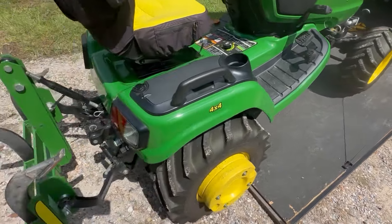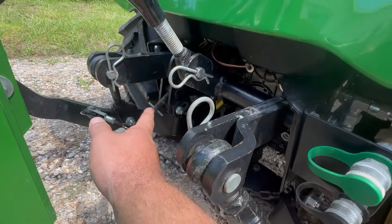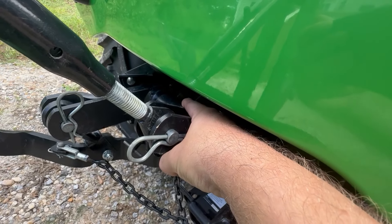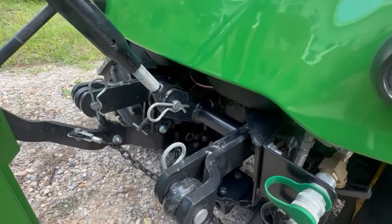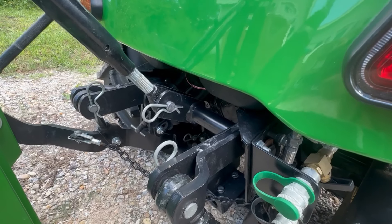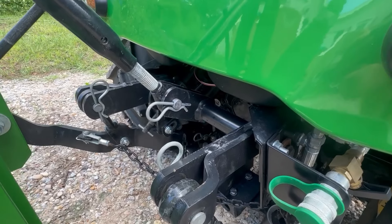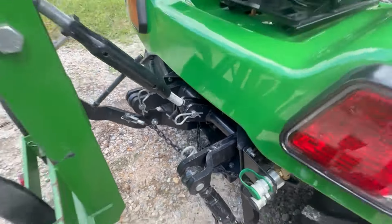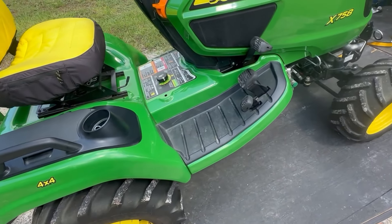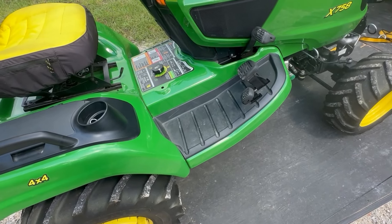I also noticed that back here on the three-point, when you turn it there — it's probably hard to see but you can see it right at the tip of my finger — there's that little square lock nut that used to go all the way past this rear rock shaft to where it would not engage the rock shaft. I kind of had to manually hold it in place to get it all the way back to where I could actually turn that adjuster screw. So I knew there was something a little bit wrong and I was trying to figure it out. I'm going to take you under the mower deck to give you an idea of how the deck height adjustment works.